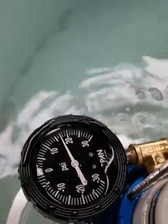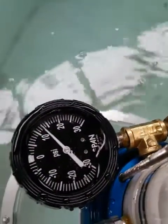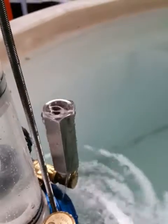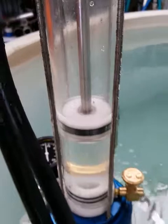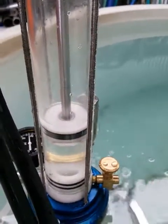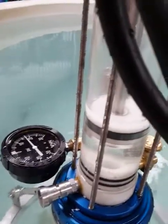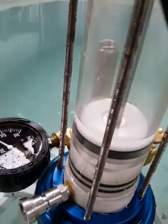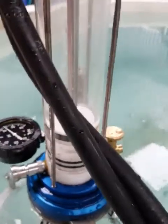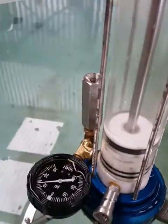Maximum 17 psi — and we can see the liquid coming out of the exhaust valve. It's a very simple operation for the low pressure sampling tool: maximum of 17 psi, cracking around 12, averaging around 15. So as it comes back on deck, any gas is automatically bled off to a safe limit.